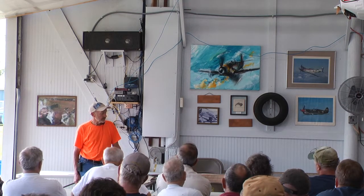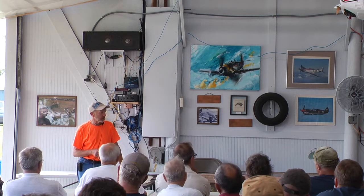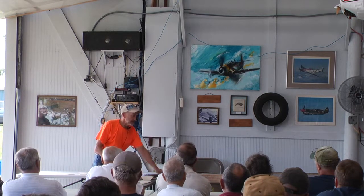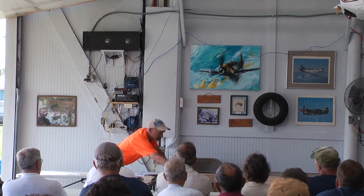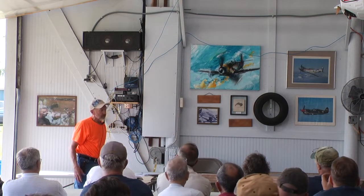After that dried, you have to be careful when you're gluing up that block so that you try to alleviate any glue buildup on the 2 faces, the top face and the bottom face. It really helps out a lot. Here you're going to have a lot of dripping glue down the sides, but you don't have to worry too much about that.